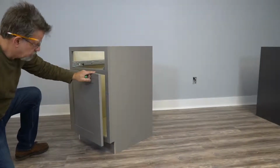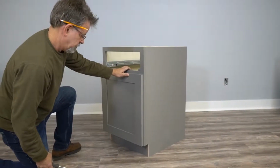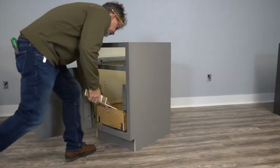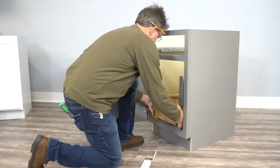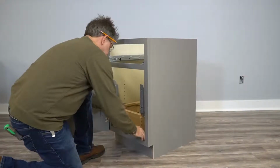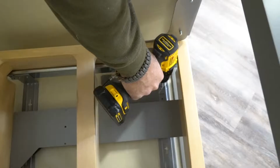Make any necessary adjustments to the cabinet door to be sure that the door is straight and maintains the proper margins on each side of the cabinet. Place the unit inside the cabinet and bring it forward, flush with the face frame. Use a tape measure to center the unit and a level or straight edge to ensure that the unit will line up flush with the cabinet door.